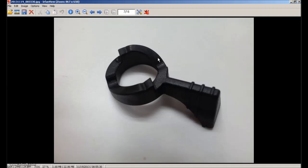So we start on this component. We have a base point at the center of the cylinder, so we can do a cylinder extrude. But the tricky part, the hardest part, is for us to do this kind of geometrical shape. If you look at this cylinder, we have a kind of involute, a kind of curvature here. We have a curvature that is repeated twice. We have a flat surface here, a groove downward, a curvature upward, and a little groove where the pin will stop.